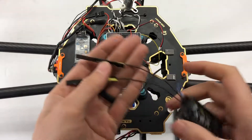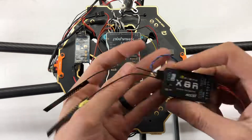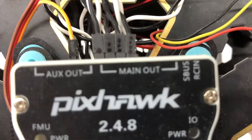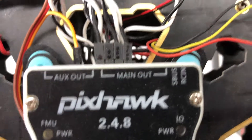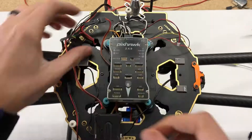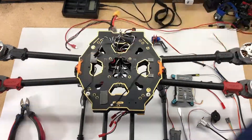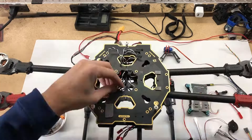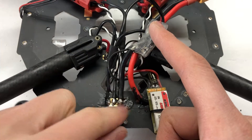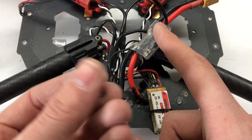I still hadn't even got my new receiver connected or set up, so it wasn't placed on there nicely. I have my ESCs all mounted with the correct numbers — dot one, two, three, and four — for what motors they represent. This liquid tape is awesome; I highly recommend using liquid tape when you build your drones so you can cover up all your solder joints. I'll leave a link in the description of where you can get this.